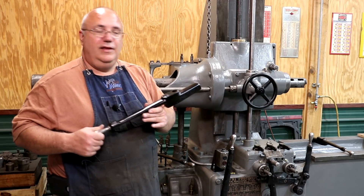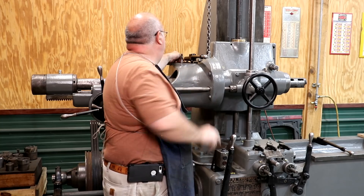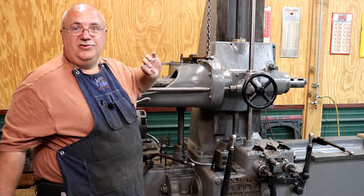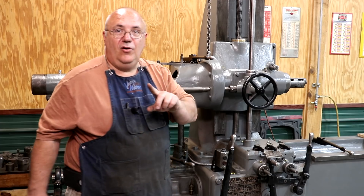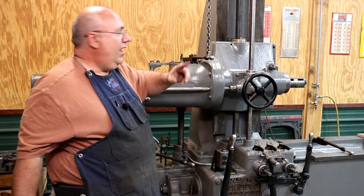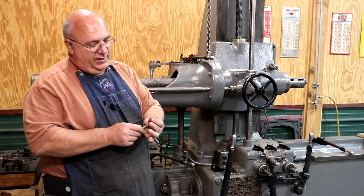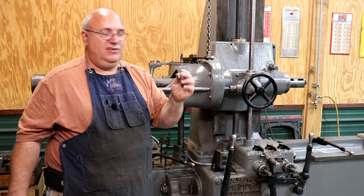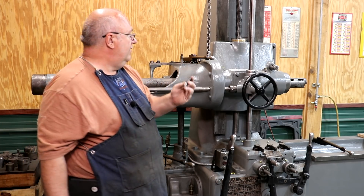On this, there are two little levers that fit right up here. There's a pin that it just kind of drops down over and a piece in the back. You basically slide these left and right and it changes some adjustments in here. I think this has to do with the feed rate of the quill going out, if I remember right — don't hold me to it. There are a couple of different settings to adjust some gears back here. The problem is, when I took these off, there is a little spring-loaded pin that goes into a detent and basically holds this thing in one position or the other, and one of these pins was missing on the machine. So we're going to make a new pin — that's today's project.